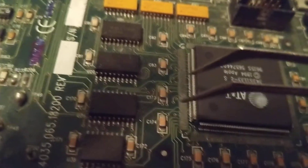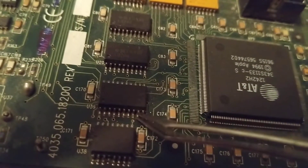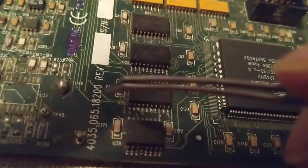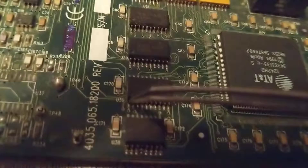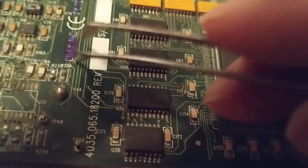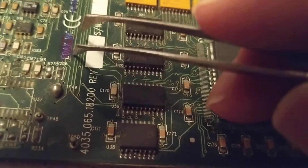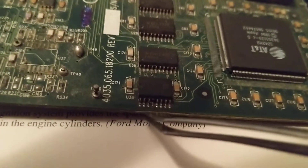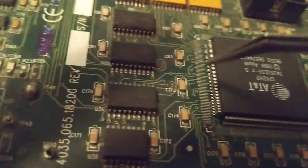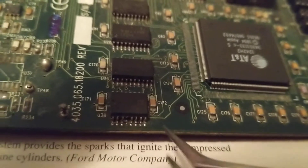There are different types of chips on surface mount computer boards and instrument clusters, and these pins come up as a common failure. The other problem is the lands — these copper traces that make the connections. Instead of hard wires, a connection goes from one pin all the way to wherever it's connected, sometimes through a hole called a via that goes to a layer underneath. You can follow a trace to a via here — meaning this connection goes to an inner layer, through the multi-layer sandwich.